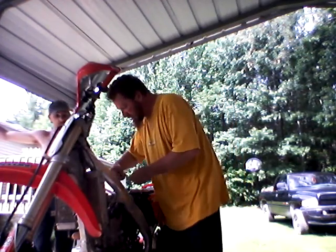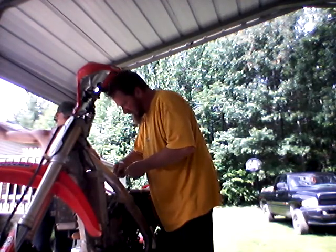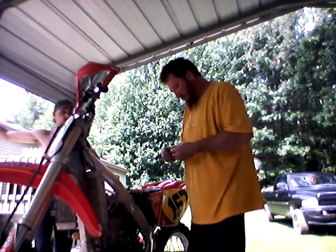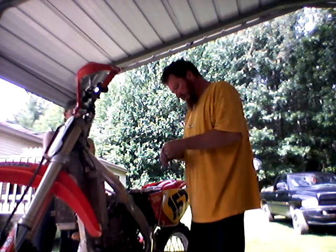Do you think you might have the shims up there? I don't know. I didn't even see any shims in there whenever I was. There's an 8. We've got to figure out what shims we need first. Let's see where we're up to. We'll jump up to a 13. One side's a 6, one side's a 13. So far, 13 won't go. There's an 11. My guess is that's what it is. Or a 10.